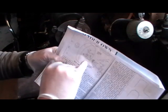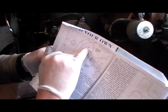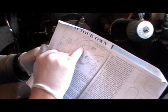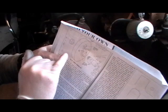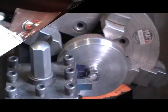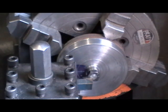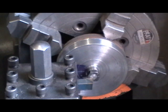In the jig you've got to mark off from the centre one inch radius on the centre line, and we've got to drill a hole in the jig 9/16th diameter. That's to allow your half inch reamer to run into when you're drilling. I'm just putting my bolt in the centre, and I face the bolt up so I get the point of my tool dead in the centre of the jig. Then I've set my dial to zero on my cross slide.